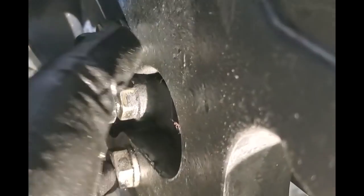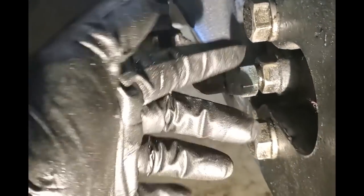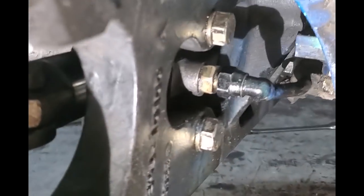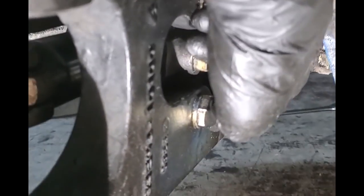Okay, our hydraulic steering cylinder is now installed. It's installed with four bolts on the back side of that, or the front side of the axle, where the hydraulics comes in. So this is the end feed for the hydraulics, and you've got your two bolts on this side. And then you have the same thing on this side. Two bolts holding the hydraulic cylinder on, your end feed for your hydraulic cylinder. And this is a shot of the cylinder.